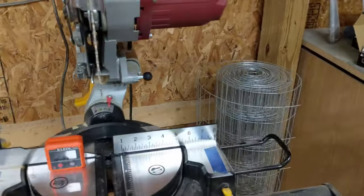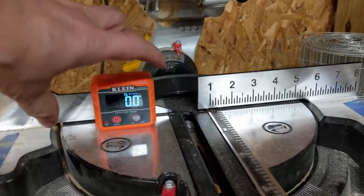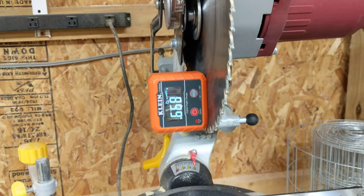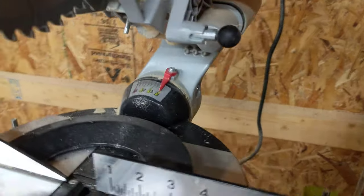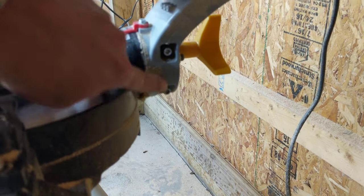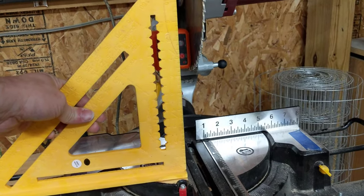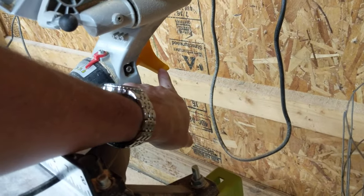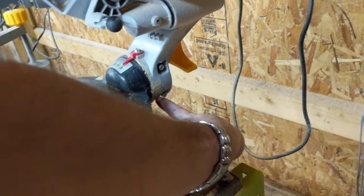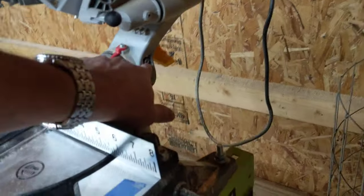First, squaring up the blade, which is easy. The table is at zero and the blade should be at 90. Right here you have two screws — the upper one is for your 45 stop, the bottom one is for your 90. You can use a small square or a digital gauge on the blade. Loosen the set screw and adjust your 90 stop, then flip it to 45 and adjust that set screw so it locks at 45. Now you're good both ways.